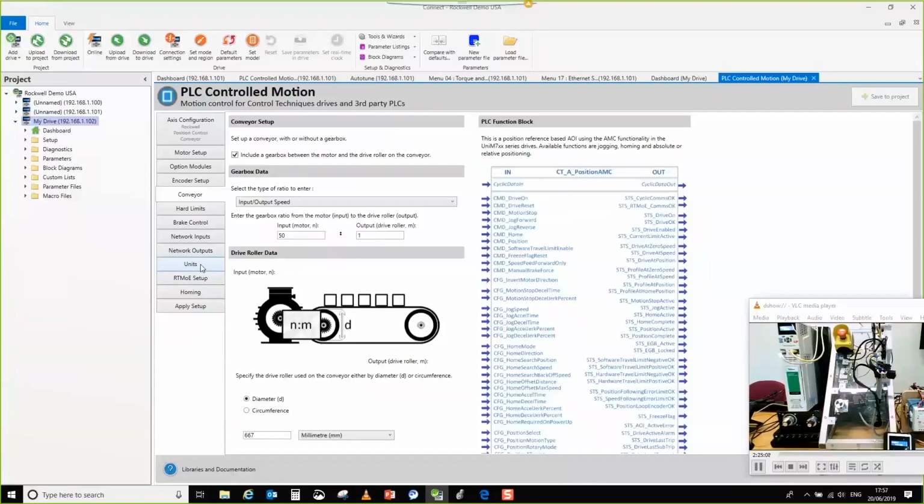Okay. Basically the reason why it has to be drive P1 is because drive P1 always exists. When you're setting up your cyclic communications, you always need a point for the cyclic communications to route to, so that you can configure from the PLC properties related to that particular encoder. For closing the position loop, it's the only one that exists all of the time. So 99% of the time when you're not doing a dual loop application, drive P1 is the owner encoder, and it does your speed and your position loop. But the low-level reason is we control the freeze setup, and in order to have a fixed cyclic mapping, you have to know the location of the freeze stuff that you're resetting, which means we have to fix it at drive P1.